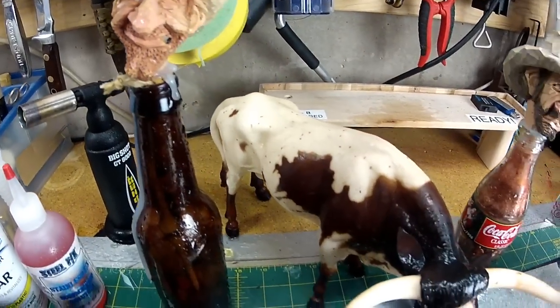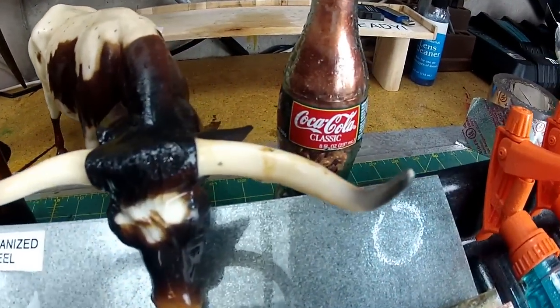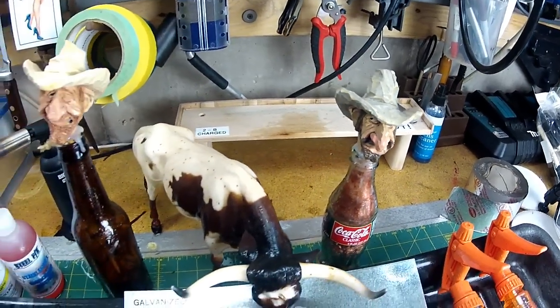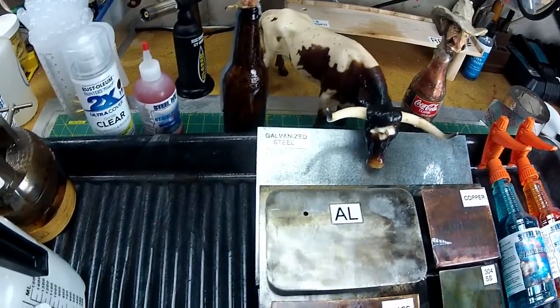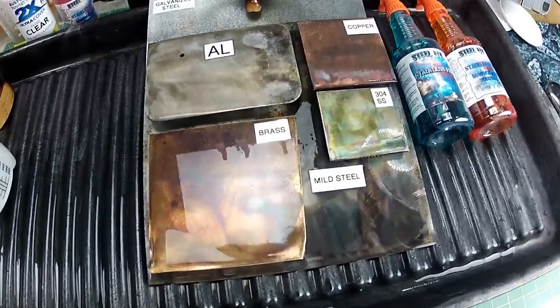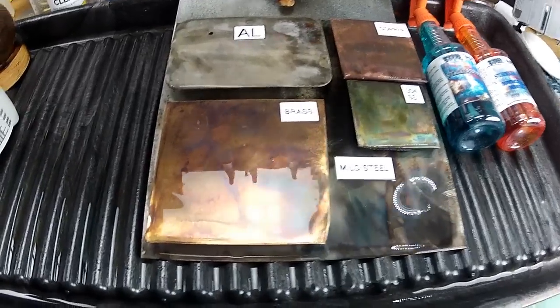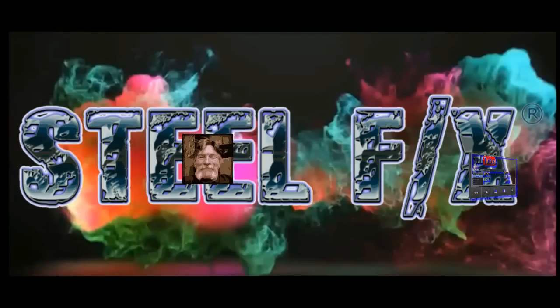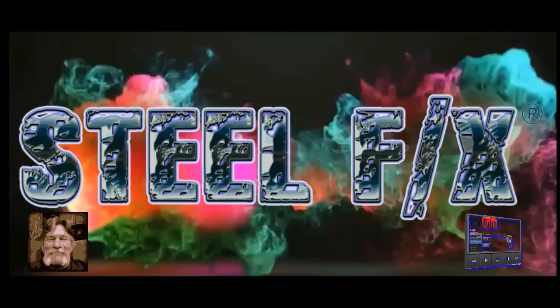Here's my buddy — I think his name is Burl. I'm working on a three-foot by eight-foot packing table inside the shop because it's about 110 degrees outside. To carry the runoff, I tilted the upper right corner and the lower right corner, drilled a hole through, ran some eighth-inch copper tubing through it, flared the end, heated the plastic, and embedded the copper into the plastic — it goes underneath my table into a bucket. My name is Bill Worden; I not only guarantee great products, I guarantee great service. You have my word on it — thanks for watching.